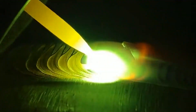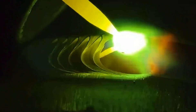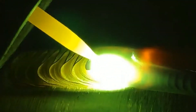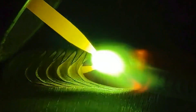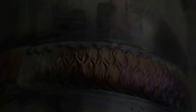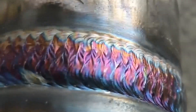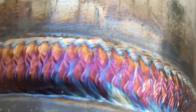When closing the arc, ensure that gases inside the molten pool are fully discharged. Avoid closing the arc too fast, as exposure of the molten pool can cause air intrusion, resulting in defects such as cold shrinkage holes and internal air holes. This is demonstrated by a natural gas pipeline of 5 cm thickness after bottom filling and cover surface filling. When covering the surface, the edges should be clamped to ensure straightness of the weld bead and to make the formed weld bead more beautiful.